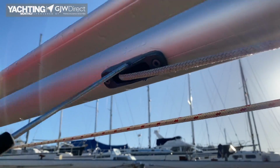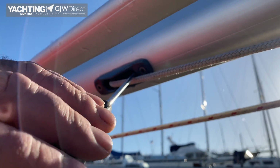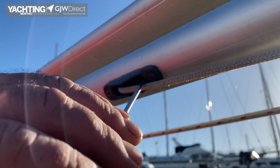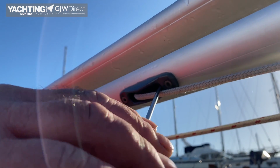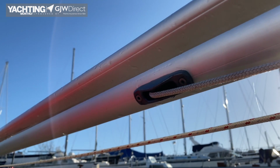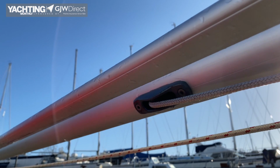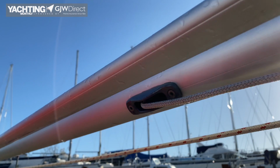So here we are on a sheave, example of testing the sheave. So I just put the screwdriver in and just gently, you can see it moves slightly, and a new one will. I'm not worried about that. It's trying to decide what's excessive. And if it didn't move at all, it probably means it's seized, so we need to look at that as well. Rivets are good, all nice and secure. The halyard looks all right, it all looks okay.